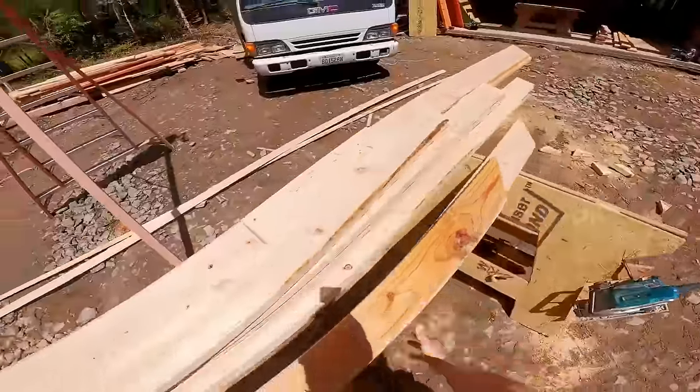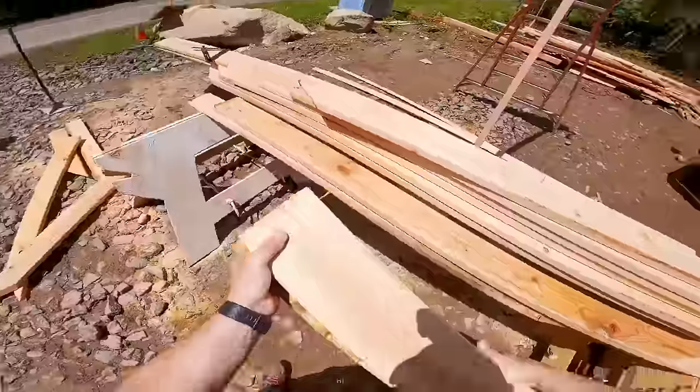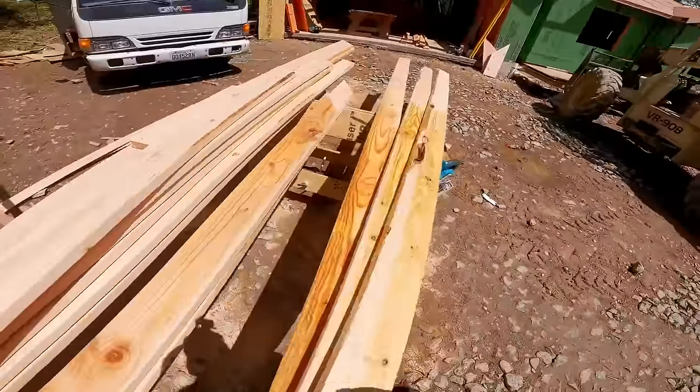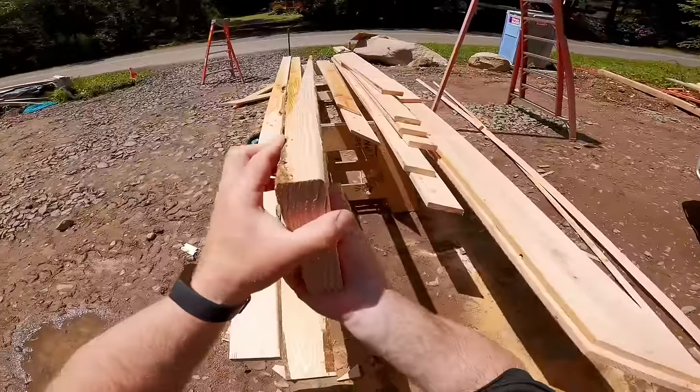And since I'm hooking the long point of the plumb cut, sharp to sharp to sharp to sharp, that's just how we do it. So this way, I'm cutting to the sharp of the bevel, which is easier for me to cut since I'm right-handed the way that I'm doing it, as you can see.